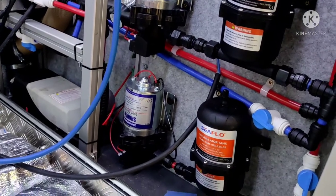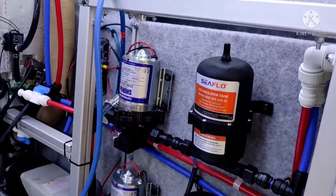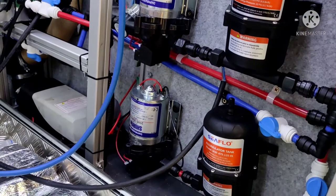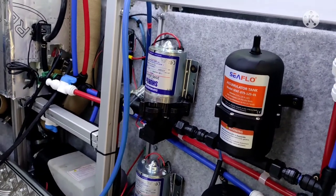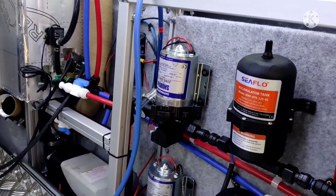I'm going to do the wiring in a separate video, because I'm actually going to put some relay controls in for the pumps. Not because the pumps especially need relays right now, but because we've got further plans making use of some Arduinos that will put some automated control into it — and it makes sense to have the relays so the Arduino can turn them on and off.